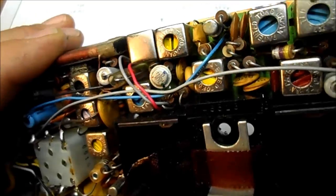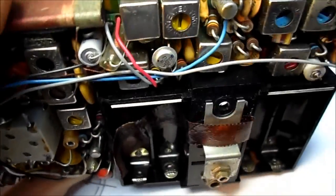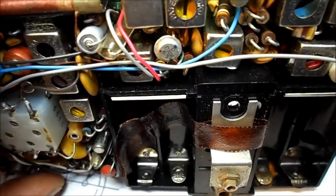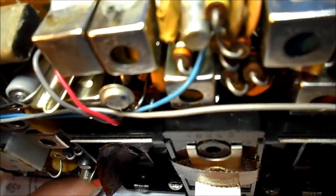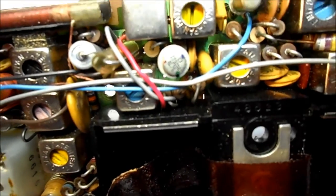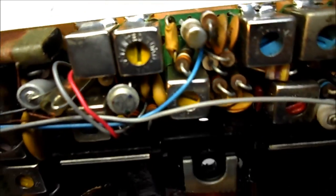It's in there. I had to use every piece of that transistor lead. If I went down it would touch the can — the case would touch the can. I couldn't go to either side because there's resistors there and some other component. And then there's the other IF can, so there's like no room in there for this thing.